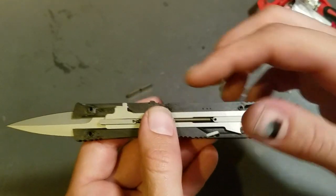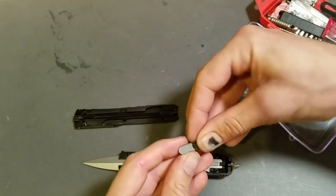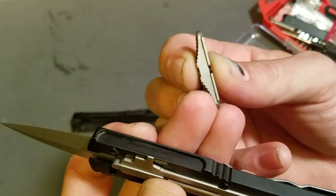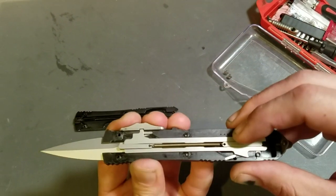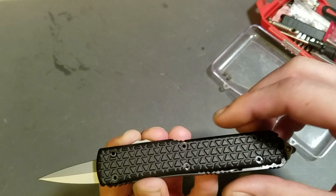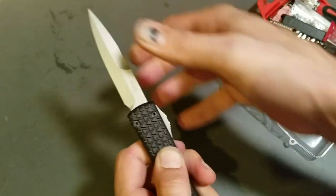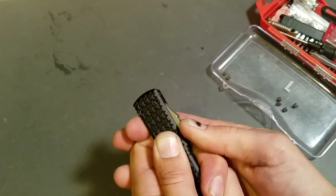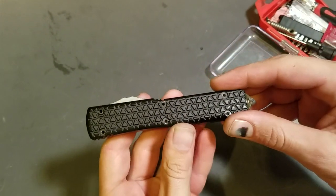Align that. Get your little spring, set her in her hole. And this button here rides on these little tracks, so you just line up the little tracks and place it on. Make sure everything's got tension — you can see it's not moving anywhere, and you can see those little tabs is actually what holds the button on. So now I'll just stick the top frame on, make sure everything's matched up. And before I even stick any of the screws in, what I'm going to do is pull the blade all the way out and test the mechanism.